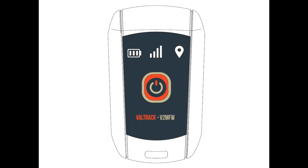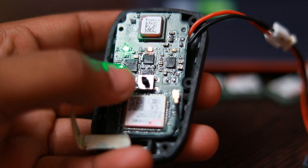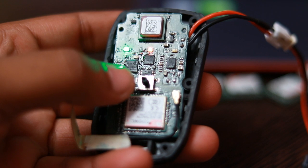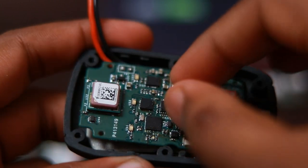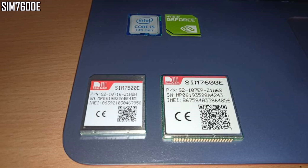I am eagerly waiting to see how they look after the customized enclosure with cutouts and stickering arrives. Because the device PCB is much bigger than the V2MF, it was quite easy to work with and the GPS performance is also greatly enhanced due to the bigger ground plane available. It catches a location fix in a very short time — about 30 seconds on boot up — which is fantastic for power savings and quick tracking applications. Both 2G and 4G versions of these devices are getting developed in parallel, and the 4G version will use the SIM7500E module due to its smaller size compared to the SIM7600E.